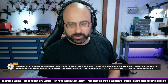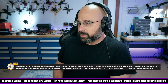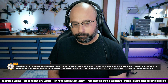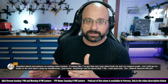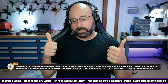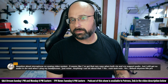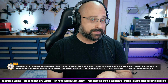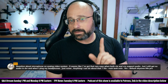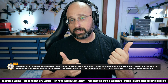Here's a question from Fern, a patron in the Discord: I've got a question about a microphone on analog video systems. It seems like I've got that rare case where both the VTX and the VRX support audio, but I get no audio in the DVR. The reason for that is likely this: the video signal format supports stereo audio, so the signal can have both a left and a right audio channel. Basically all video transmitters only transmit one audio channel because it's mono, and basically all video receivers — like in your SkyZone goggles — only receive one audio channel. But sometimes the video transmitter sends the left channel and the video receiver receives the right channel, in which case you get no audio.